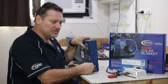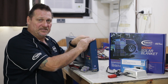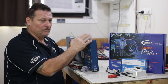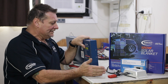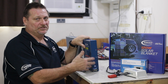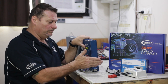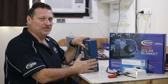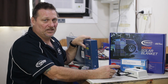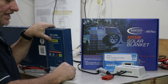You can't plug solar into it, and the reason is the lithium battery has a BMS inside — the battery management system. It protects the battery for over and under voltage as well as temperature and current. The main reason is if it gets over 15 volts it shuts the battery down, and solar is around 18 to 20 volts when putting a charge in. So ultimately you can't go into that because the BMS would shut it down.